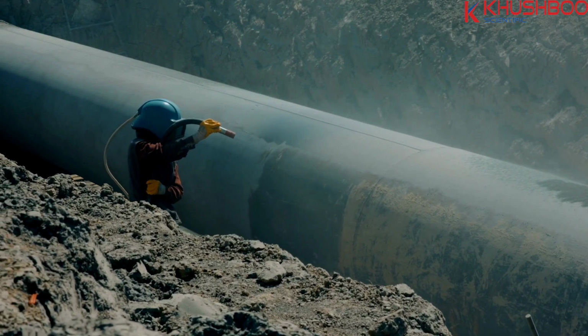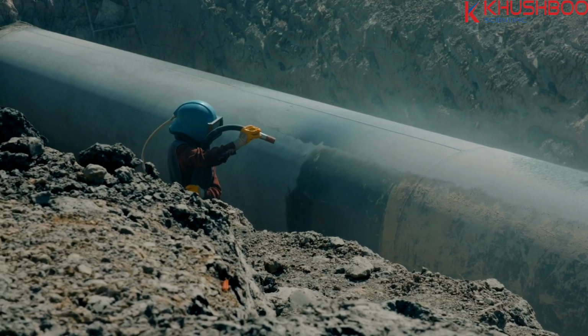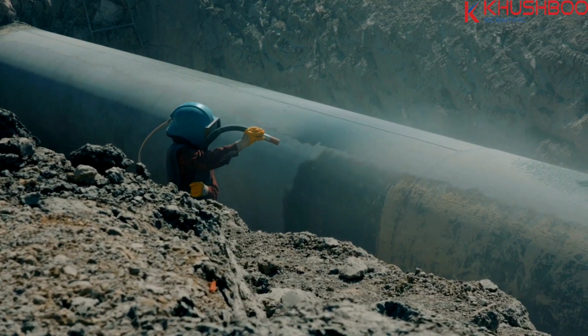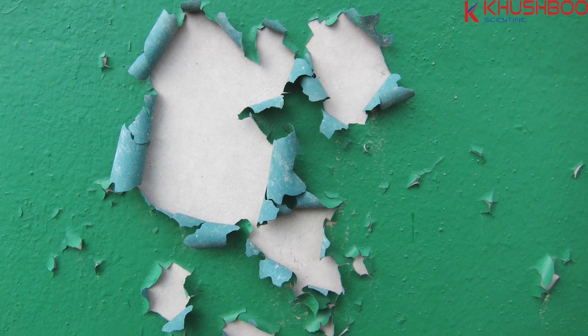Steel surfaces are frequently cleaned by abrasive impact prior to the application of protective coatings. This process removes previous coatings and roughens the surface to improve coating adhesion. The resultant surface profile is comprised of a complex pattern of peaks and valleys, which must be accurately measured to ensure long-term coating performance. A surface profile height that is too low may reduce coating adhesion and corrosion resistance.